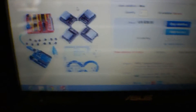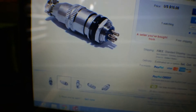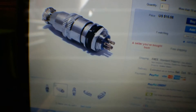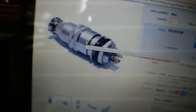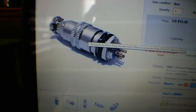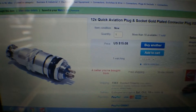Hopefully it's good — I haven't heard any bad reviews on it. I also went ahead and bought some aviation plugs so I can keep everything wiring neat. This side will screw into the box and this part will go to the wire coming from the CNC machine. If I ever need to move it or service the controller I can just unplug it quick-connect here and everything comes off. I ordered a pack of 12 for 15 bucks, which is a really good deal.